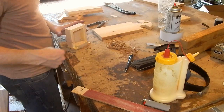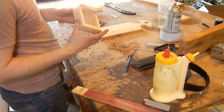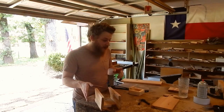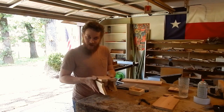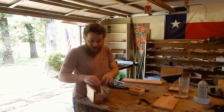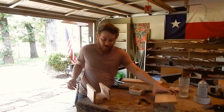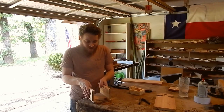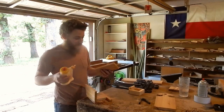I'm just going to use some rubber bands, then set that aside somewhere to dry. I think I also want to go ahead and glue the sides onto the front now. I don't want to glue them to the back because if I get these flush on the sides of the front, that leaves the cup facing inward. I can put a temporary spacer in there to spread it out and get it flush with the sides of the back. But if I glue them to the back first, that cup is facing inward so they don't line up — that would be more of a pain. So I'll glue them onto the sides now, and they're just getting edge jointed.